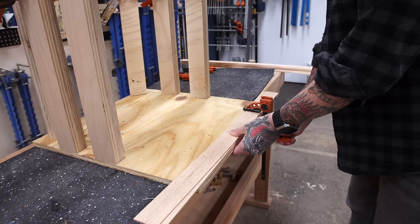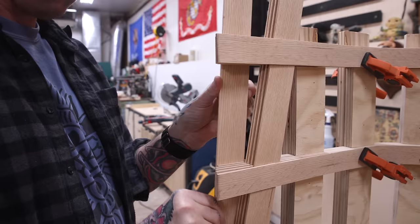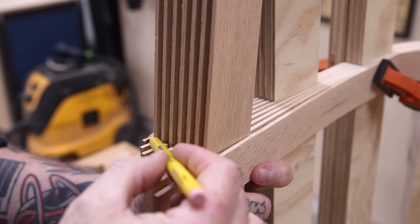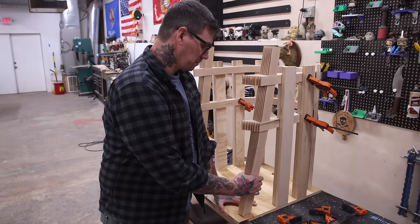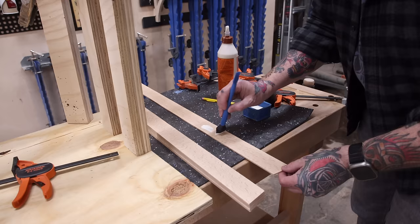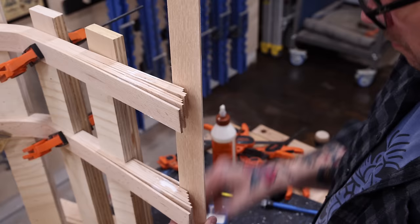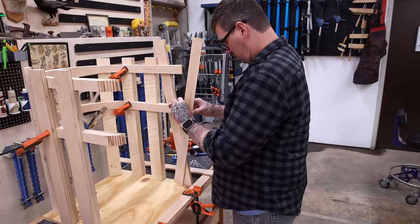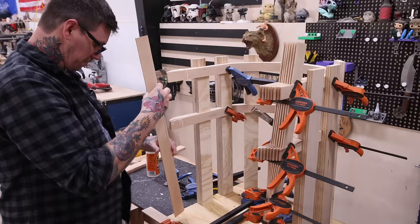I often fret over a particular part of a build only to have it end up being really easy — and such was the case here. Initially I was just going to do a dry fit to make sure everything lined up correctly, but I realized I could use that dry fit to mark my glue line, because these slats spread open for the finger-jointed sections and I don't want visible glue residue in those open slots. This gives me a reference line of where to add glue — or more accurately, where not to. I'm using a straight-edge clamped to the front of the jig for a consistent spot to place the leading edge of the strip, cut to nine degrees.